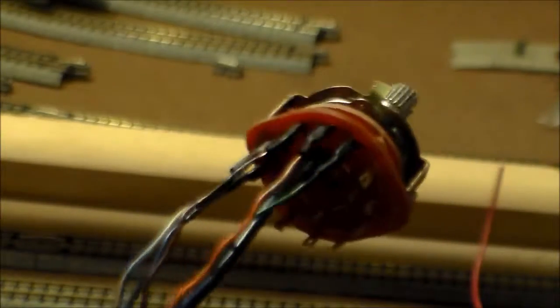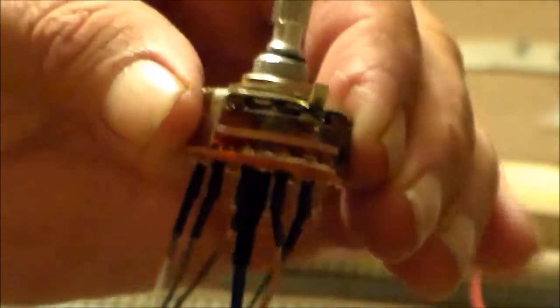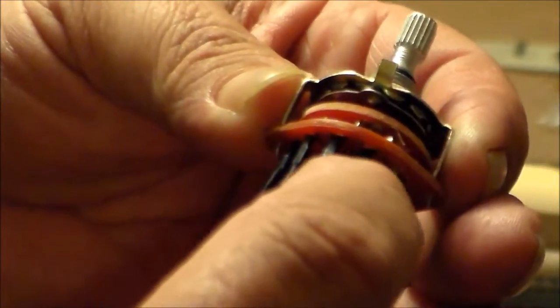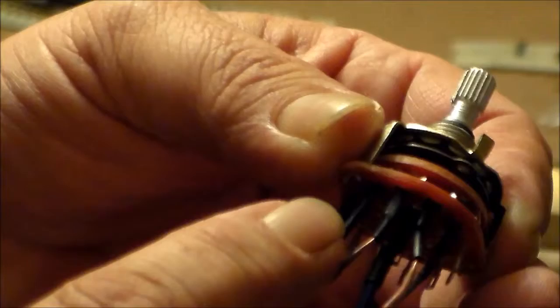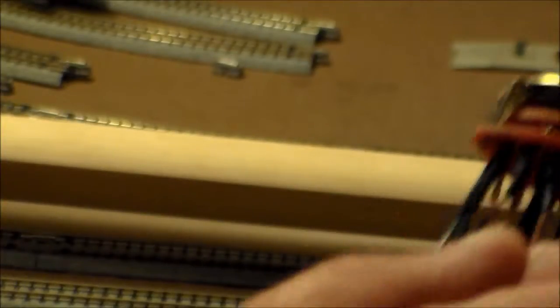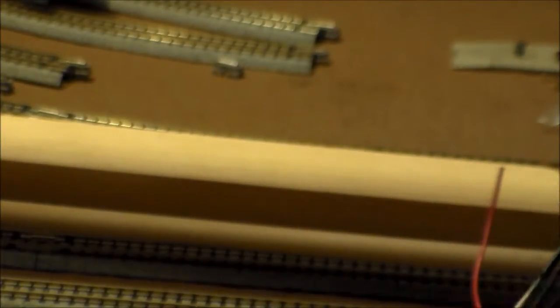On the rotary switch, you've got your wires going into the back. Each one has a place, and you definitely want to use heat shrink tubing on that. I use internet cable — the blue CAT cable. Since I'm using just five or six positions I really only need five wires. The blue internet cable has eight wires so I cut off three extras. I've got them all color coded and each switch is wired the same with the same colors, so there's no confusion. It's all schematic'd down.